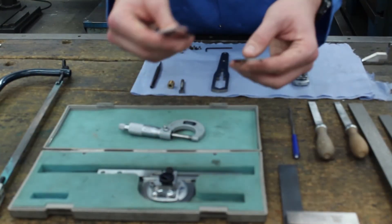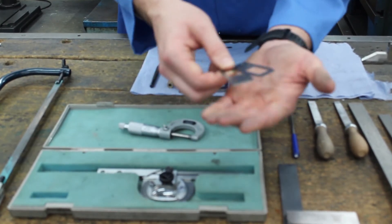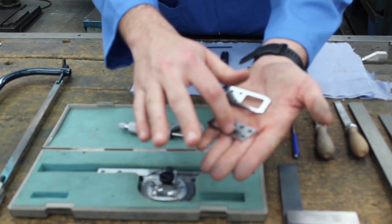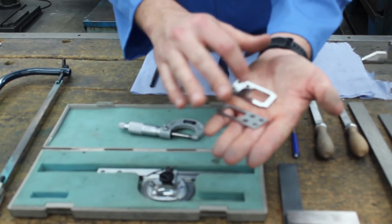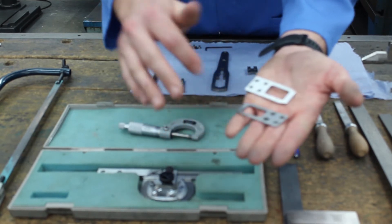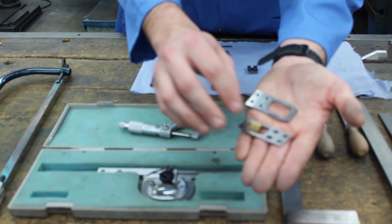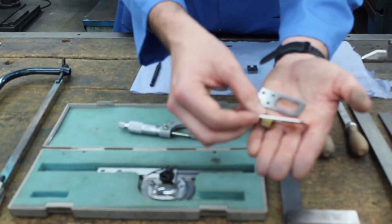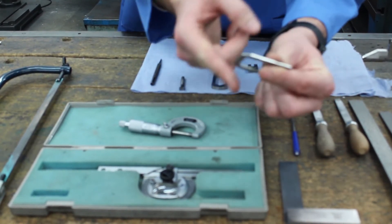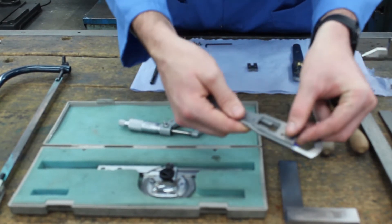The adjustable spanner has these two plates. These plates hold the jaw in the spanner. Simply, we are going to get four drills on each end that go into the jaw and then get the inside cut out for the nut to sit in. Then we cut these angles on the ends which means it fits nicely and sleek with the design of the spanner.